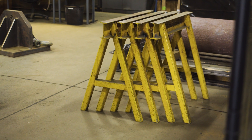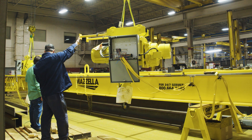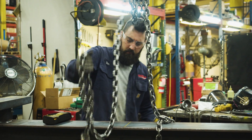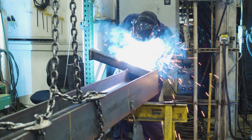In our shop we use these horses mainly in our fabrication departments. We use them for helping us to span our overhead cranes, when we're building larger lifting beams, and when we're building things that are too large for tables and we need to support and elevate them. We'll use two, three, four, sometimes five of them positioned around to hold the product off the ground.